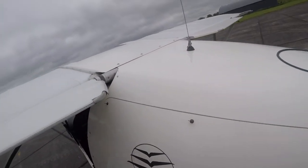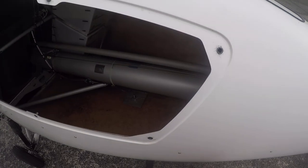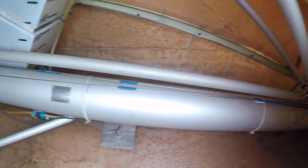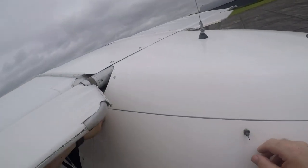Here we've got our fuel and luggage compartment. Take the panel off and there are a few things to check in here. We check that the fuel is sufficient — we have 50 litres of fuel. Check that there are no leaks and no loose items inside this area. The cables, rods, and everything look as if they're in the right place. Put the panel back on — always make sure you put the panels back on. Use the two corners as the key ones to hold it in place, then the rest go in easily.